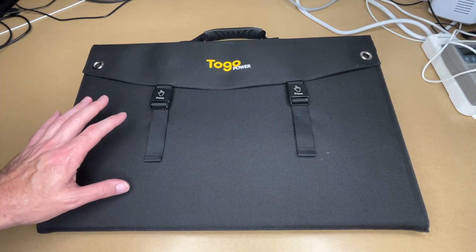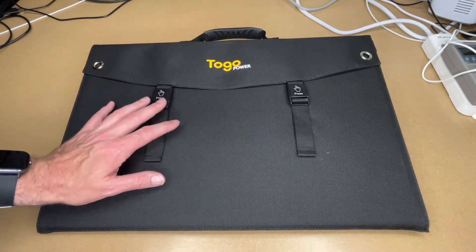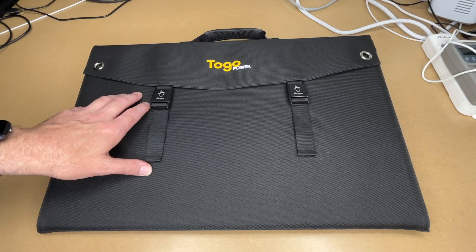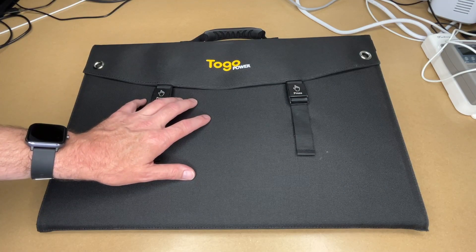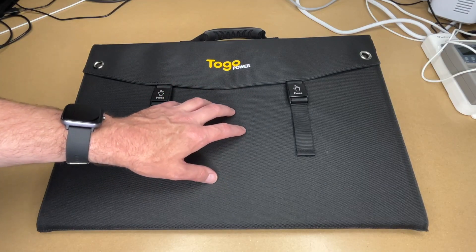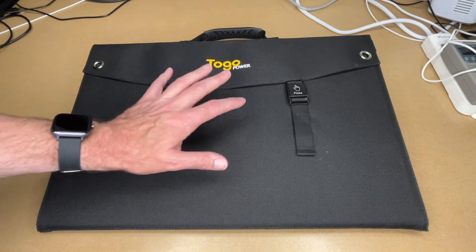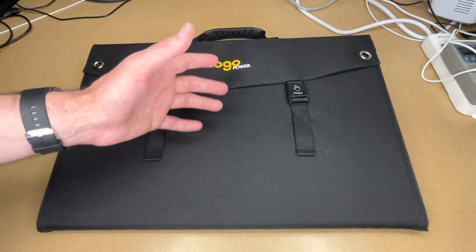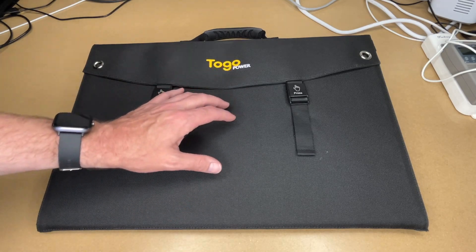That concludes the charging test. It was slightly overcast but pretty bright, and there were a couple times it got into shade requiring adjustment. Like any solar panel, it's only as good as the sun reaching it. The Togo Power power station I was charging is 634 watt hours — we filled about two-thirds of it in about six hours. I could have started earlier or had a sunnier area for quicker charging. I think through a full day of charging it would fill the whole thing. The lawnmower battery I used to drain it is around 450 watt hours — a good sample of something large you can power and then replenish with solar.